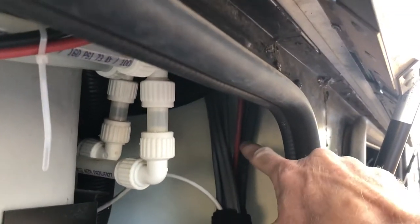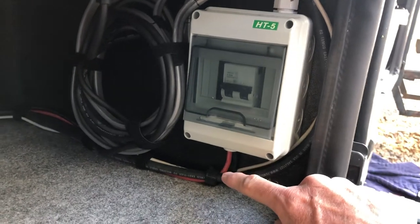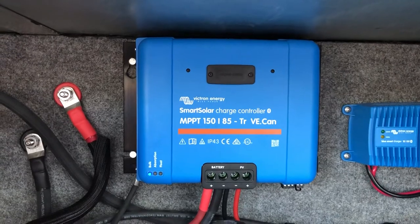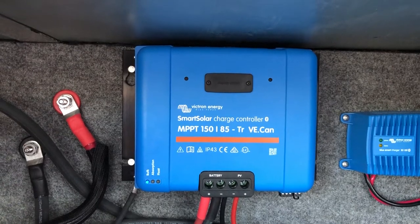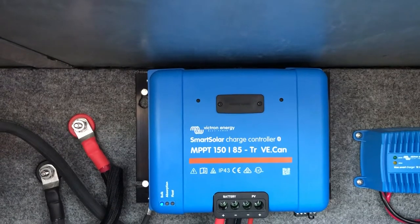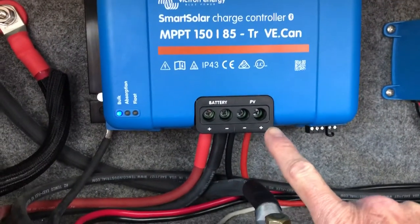The red wire in the back comes through and down into this disconnect switch — it's a 60-amp circuit breaker. The red and black wire from that feeds the charge controller, this blue device right here. There are two arrays on the roof: four panels in series, and both arrays connected in parallel. We've got approximately 70 to 80 volts per array, and about 10 to 15 amps when hooked in parallel, coming off the roof.